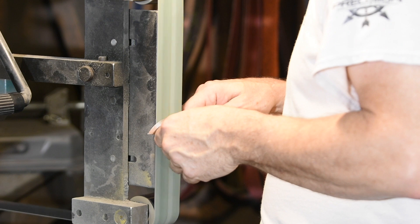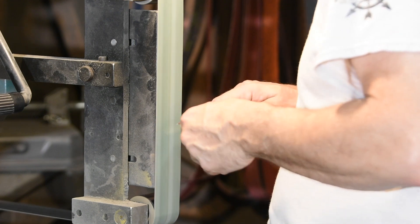If you have a variable speed grinder, back that speed down a little once you turn to the higher grits.